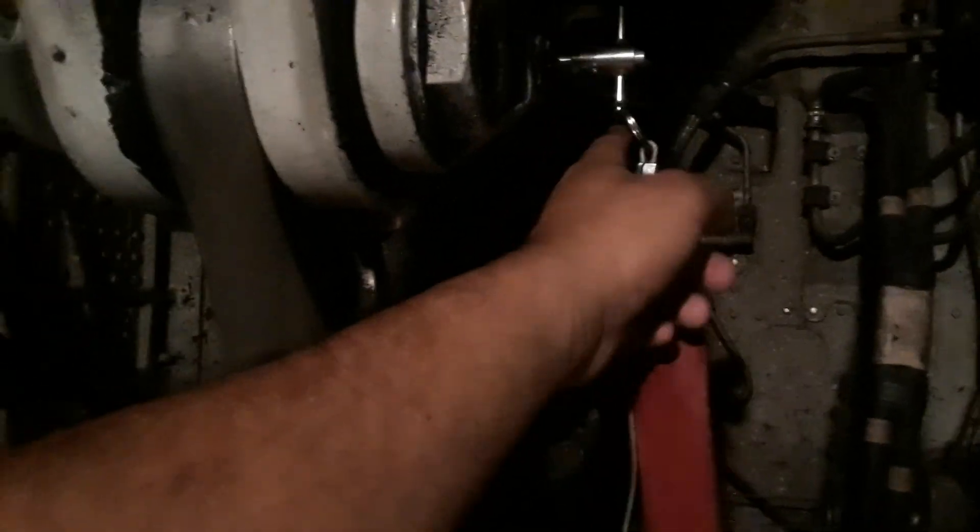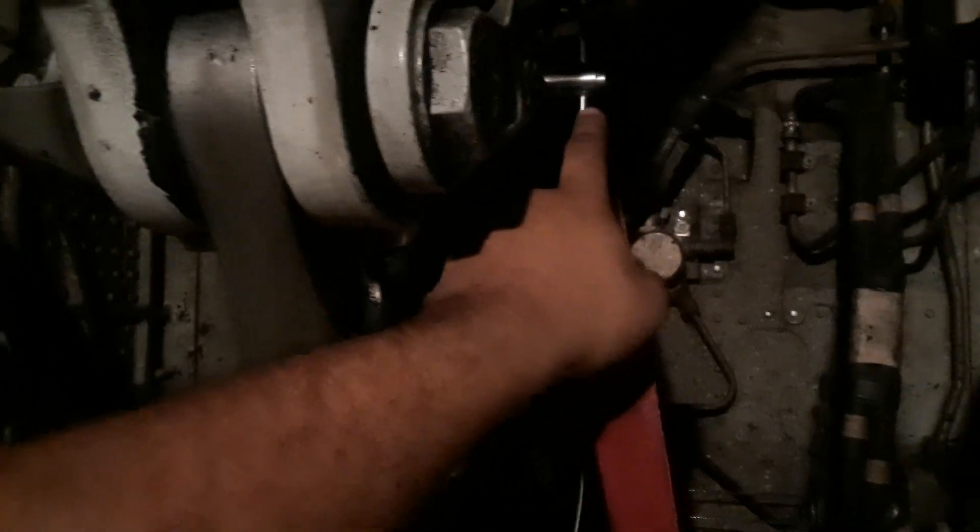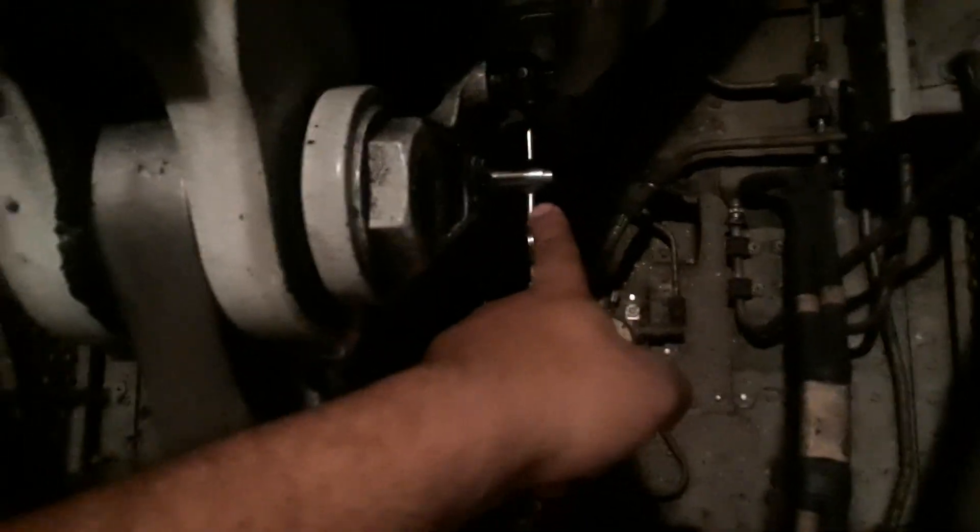And this is the other pin — this pin is the nose wheel lock down lock pin. This really isn't completely necessary, but sometimes the airlines like it. What this does is just make sure that if by some chance this goes up, this will stop it and it won't let the aircraft damage itself. So it's called the down lock pin — so it doesn't make the gear go up while it's on the ground.